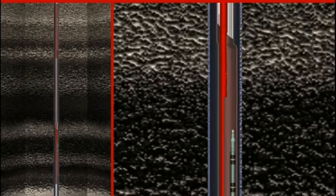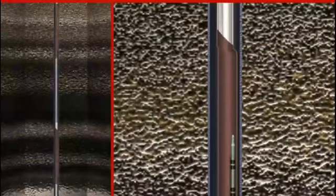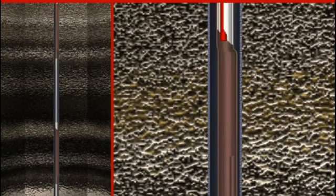The operator will then lower the tool string and allow the pulling tool to latch on to the latch and dummy valve, which can then be retrieved by jarring up. When the dummy valve is clear of the pocket, the operator will bring the valve to surface and remove it from the lubricator. This operation is repeated with each mandrel until all dummy valves have been retrieved. Weatherford's McMurray-Mako KOT kickover tool is unique from any other on the market because it does not have to be repinned between runs, which saves considerably on wireline time and cost for the customer.